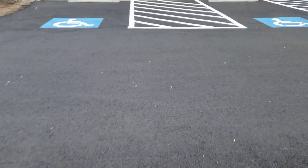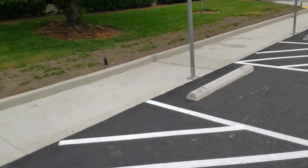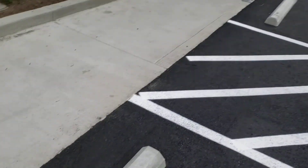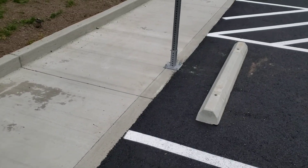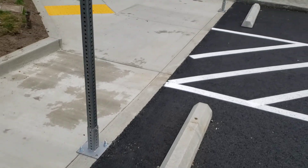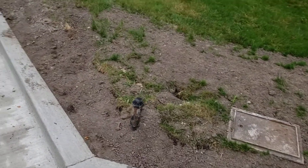I've already talked about the ADA and sloping — it's good out here. Striping looks nice, tiny bit of blue overspray but hardly any. Lines are crisp. Wheel stops are nice and in line. Signs look good — looks like we went to mount them in the asphalt and then after mounted them in the concrete, just did two bolts on each hole. And then we did this concrete also — concrete looks really nice, some really good concrete curbing.